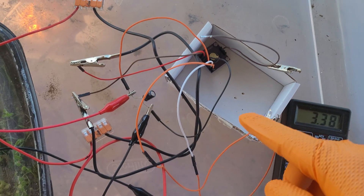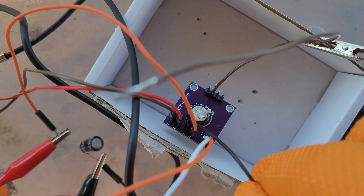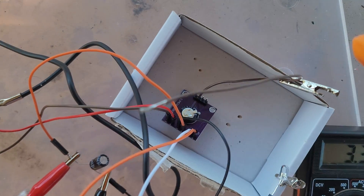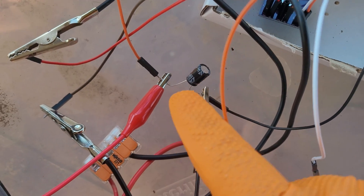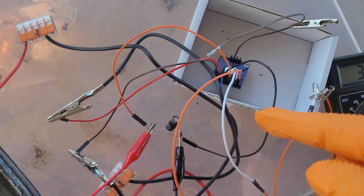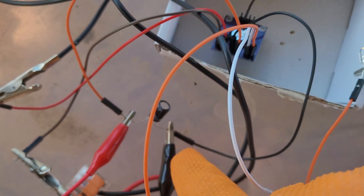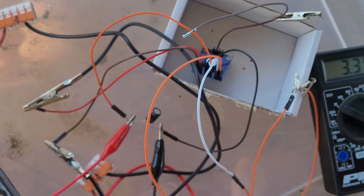It goes into this little microcontroller right here, which I got for about $10. There's a little capacitor on it that's 5.5 volts, and then this is a 10 volt capacitor I added on there. The middle two — the orange and the black — are for storage or a battery. You can put a LiPo on there if you wanted to.